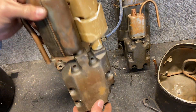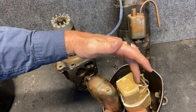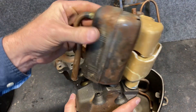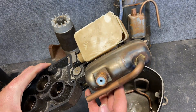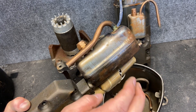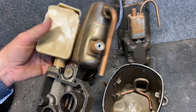With that out of the way, we have our main valve plate, or the head plate. This side is going to be suction — it's just pulling suction gas from the very top. This kind of works like an accumulator: if there's any liquid refrigerant, it falls to the bottom, but this is actually pulling suction gas from the very top of the compressor. It's usually connected to this little top cap, and it's pulling that vapor across the motor to help cool the motor windings down. On the other side we have an internal pressure relief valve, and then we have this canister — which is an internal muffler. It allows all these pistons, when they're discharging separately, to discharge into this larger chamber and smooth the flow out before it connects to the rest of the discharge line.